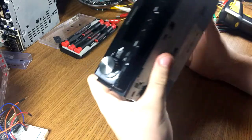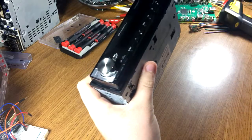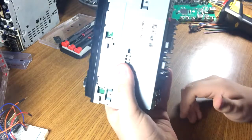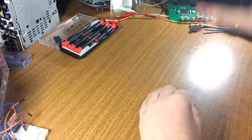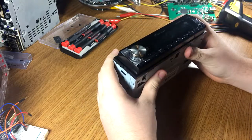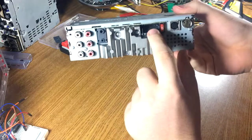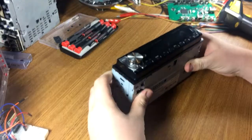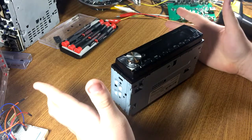I've had this in my truck for almost a year, and sometimes I turn it on and it's completely dead. The reason I think something inside is wrong is because I just unplugged it, banged it on my center console a couple times, plugged it back in, and it worked again. So I'm going to look for obviously bad solder joints, mainly on this big pin connector. Let's begin the teardown.